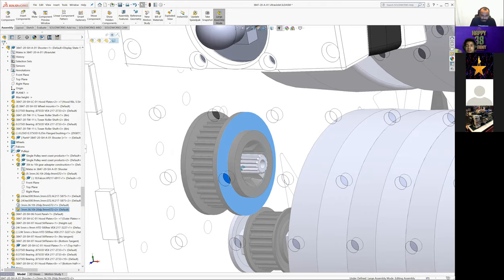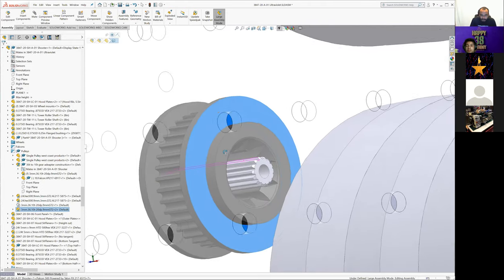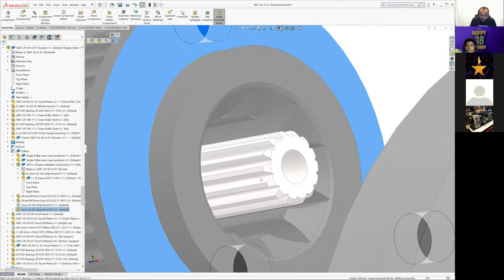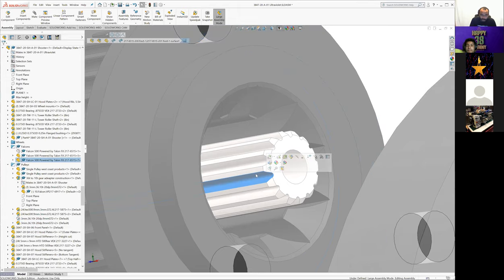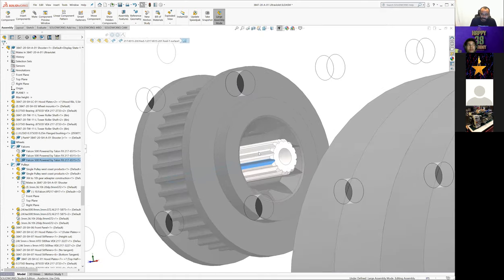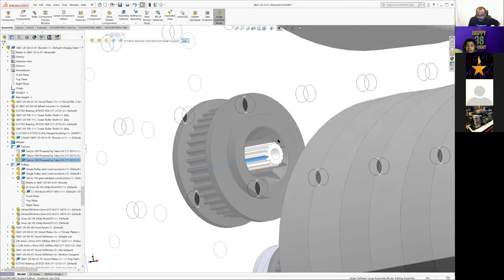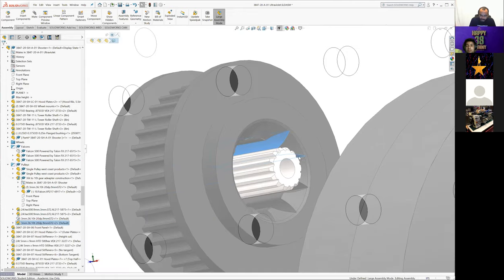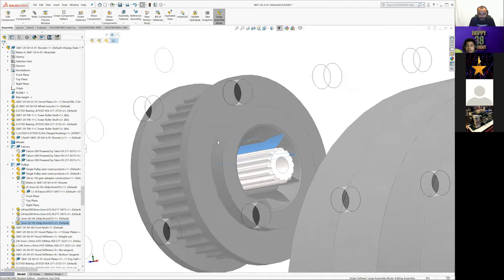And that worked very, very well for getting us a shaft adapter to this Falcon spline that wouldn't skip, right? So some teams just printed the Falcon spline directly. And while that very well likely could have worked and did for some teams, the chance of failure and where we were in our development cycle just didn't seem worth it to not spend the whatever $10 per pulley per motor to press in the pinion and know that there's no way that we're ripping out all of this plastic where the actual tooth is, right?